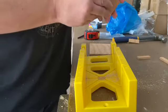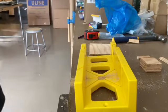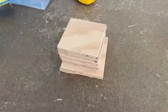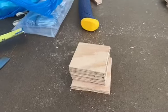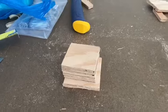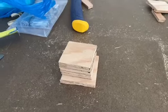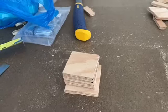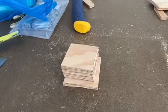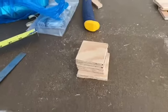So there's another cut — we've got four sides and then I'm going to go ahead and cut the bottom, which is a little bit bigger. When you're done with the miter box, you're going to end up with five pieces; one piece is going to be oversized a little bit. We did four pieces that are two and a quarter by two and a quarter and one piece that's two and a half by two and a half. The next thing we're going to do is what's called the dry fit — that's the process of putting the pieces together and finding the best way that they want to fit. Your goal is to first try to see if there is an optimal way where they all fit together with fewer gaps. From there, you will also likely need to do some sanding to get the pieces to fit together, so you're going to want to get your sandpaper at this point.